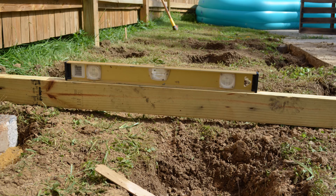Because I knew it sloped a little bit from the back of my garden to the front, I knew I was going to have to lift up the blocks a little when I came to the front. So I started with the 2x4 at the highest surface you had to deal with, because that's where you have to dig the biggest holes. My level is an 18-incher — you can use whatever you've got. Traditionally you like to use the longest level you can find, like a four-footer. Put the 2x4 down on your natural surface, put the level on top, and see what your natural surface is doing. Then you can figure out where you're going to have to dig out and where you're going to have to build up.